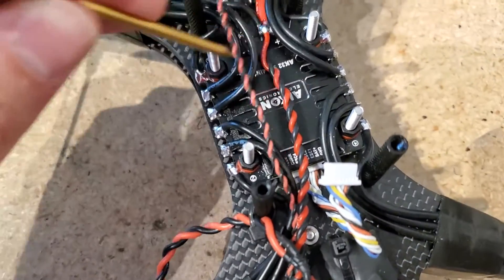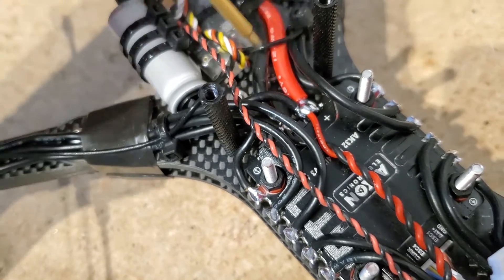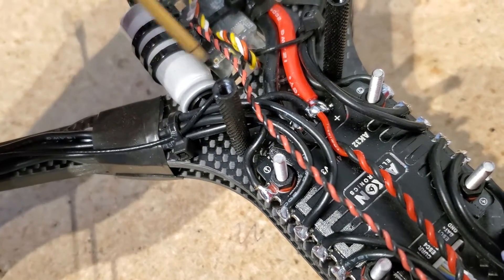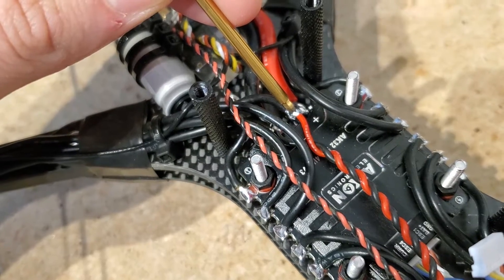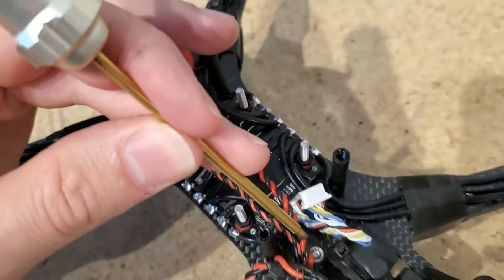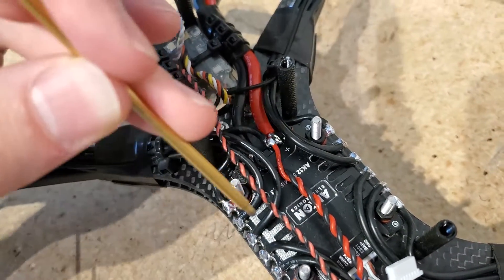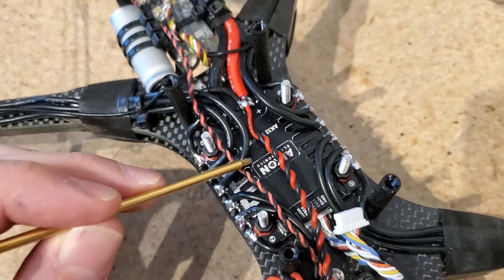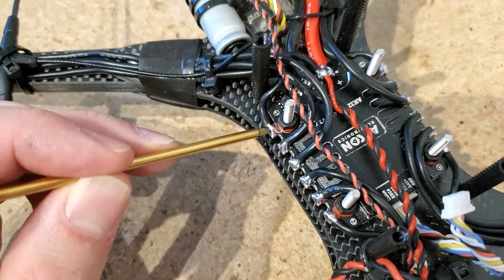I removed the flight controller — getting to the good stuff here. The ESC: it's important to note how I soldered the cables. The main power lead was the first thing I soldered to the pad. Then after that, I soldered these 18 gauge wires extending from the capacitor on top of the battery wire. Lastly, I soldered the 26 gauge wire going to both of the regulators — this wire feeds both of them. I run the motor wires from the inside over the top of the ESC in order to make it a lot more clean since we have this very narrow body. With this particular ESC, the Akon 55 amp, it's such a long ESC that it just made more sense to run the outer wire along the outside of the standoff. And it looks kind of cool too.